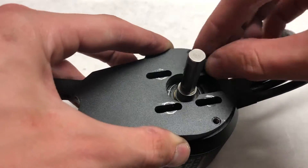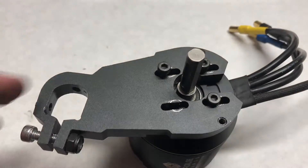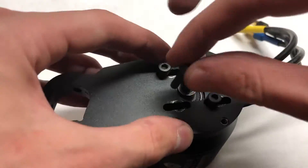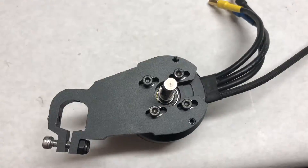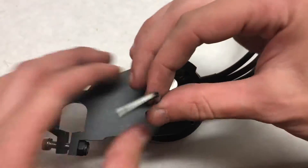The first thing to do is mount the motor to the motor mount using M4 bolts. You can then use an allen key to tighten the screws some more, but make sure not to tighten them all the way, as the motor will still need adjusting for belt tension.